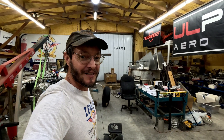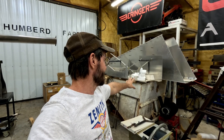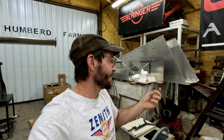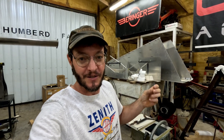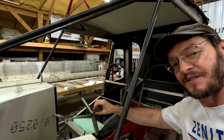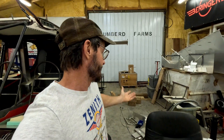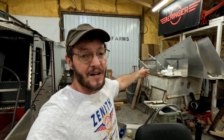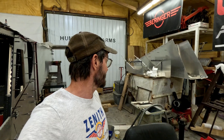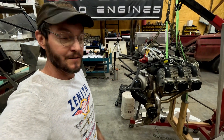I'm sitting here looking at all this titanium stuff I've already started. At this point I've already convinced myself — all the control system for this single seat 701 is going to be titanium: the brake pedals, the control stick, the torque tube, all that stuff. It's going to be a similar setup to what I have with the super duty. I'm also considering building the entire cabin frame out of titanium, and quite possibly even the engine mount when I get to building it for the single seat 701.